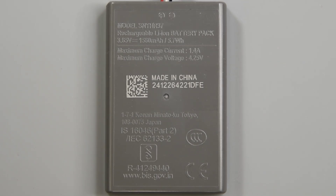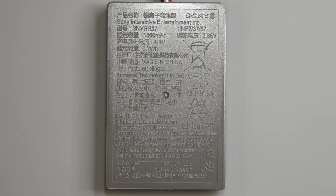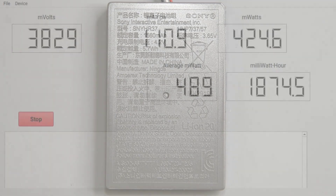Lifespan of the batteries is going to be hard to test. I'm going to need a lot of fixtures, and they are going to have to cycle night and day charging and discharging the batteries. Sony is a long-time manufacturer of lithium ion cells, and I doubt that can be said for the makers of these replacement batteries. So life cycle testing is going to have to be an important part. Maybe I find a battery with 8 watt hours, but if it has to be replaced every 3 months, that won't cut it.